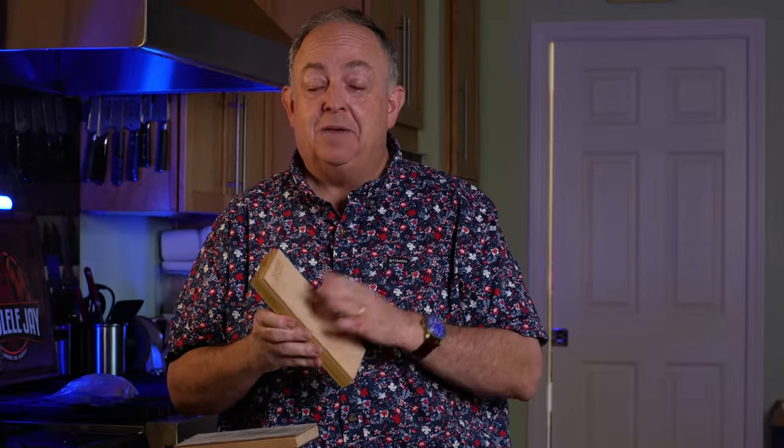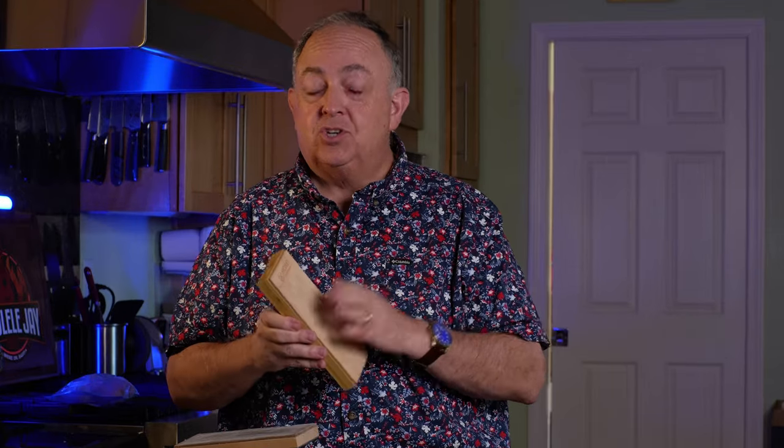The reason for that is because most likely you're going to have micro abrasions on there, which honing should take care of. With a leather strop, you end up polishing that apex. Now, some people say that's right — you're just polishing, it's for aesthetics. But I can tell you, stropping my knife, I can actually get it quite a bit sharper. It does sharpen.